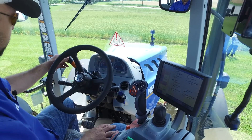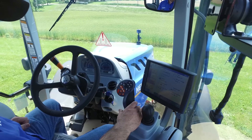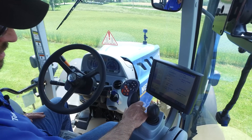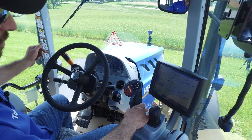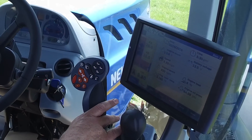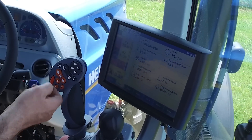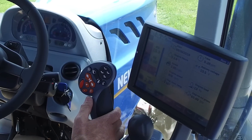Now if I want to go forward again, I can either move my joystick over here and go forward — and there we're forward. I'm going to shuttle back to reverse here with the lever — no need to step on the clutch. I just brought it back towards me. That takes us right back to where we left the stick. So we shuttled with the stick, forward and reverse. On the joystick there's also a forward and reverse button. I'm going to push forward — and you see it's changing directions, we go forward. Then I want to go reverse — I hit reverse. There's a little C down here — C is cruise. If I want to go three miles an hour without having to hold the lever, I hit C and it takes that to three miles per hour.